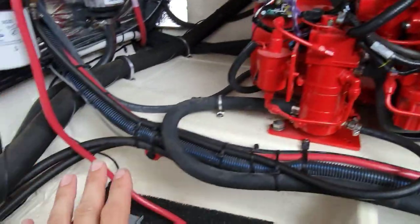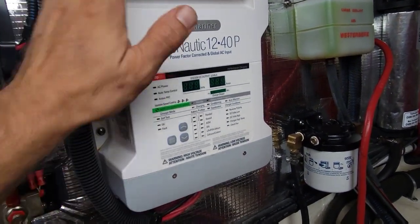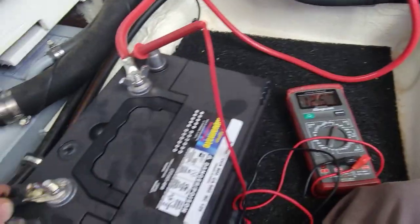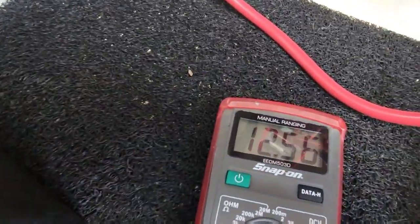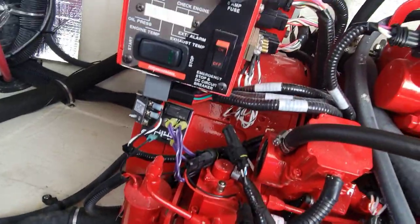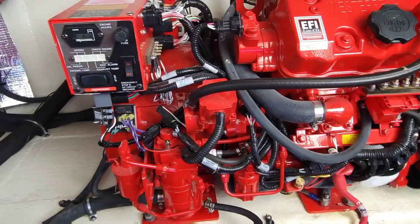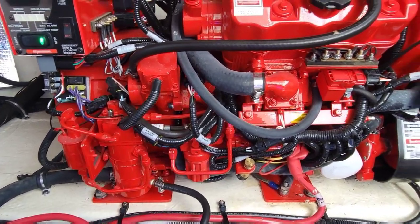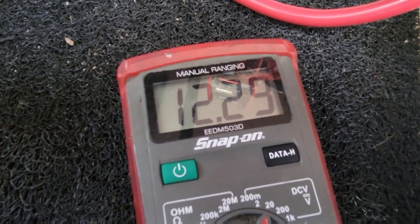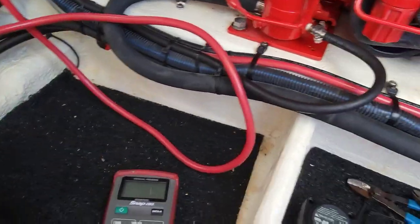We got our power wire far enough. We'll follow our ground, unhook it from our terminal block. I'm just gonna set a battery in here, put a terminal on it, and what I want to see is if when this thing runs it will charge its own battery. Typically when you have the generator running you're charging through our battery charger. I put a temporary lug on this one to check power - right now we have 12.5 volts, which is good. Let's turn the generator on and see if we have a charging system. It's not charging - it's actually using power, pulling power away from the battery slowly. So we know our battery's not charging.